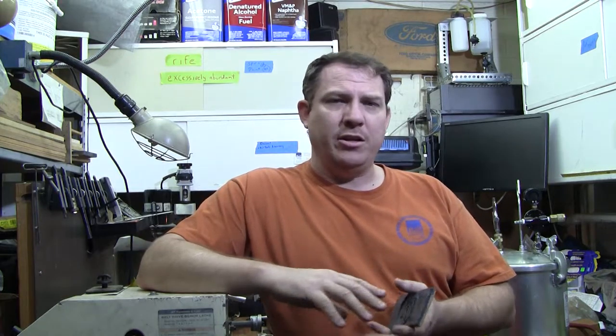The bubbles in that one actually transferred into the mold and subsequent copies, and you can actually tell every little detail, including the machine marks and the small dots where the bubbles are, and it turned out okay and usable, but I'm going to end up machining it again, and there were some small details that when enlarged to that size I wanted to go touch up, so that's one of the reasons why I'm going to recut that.